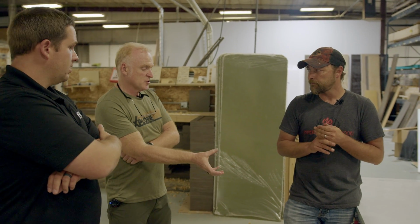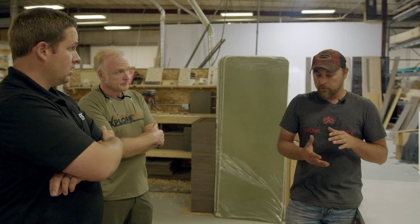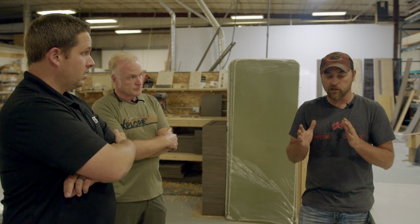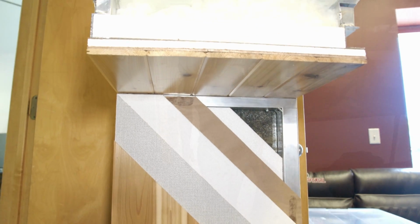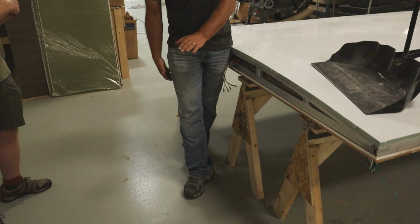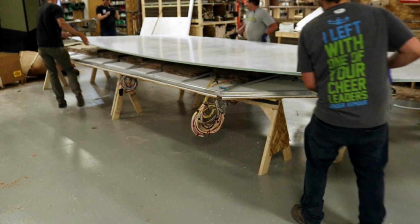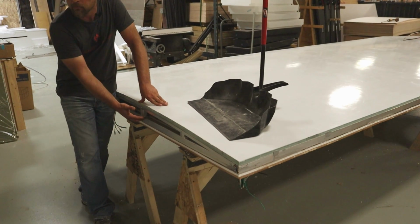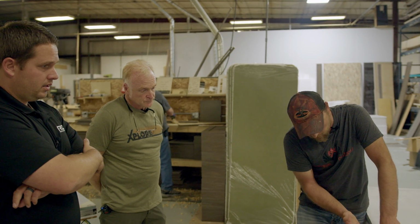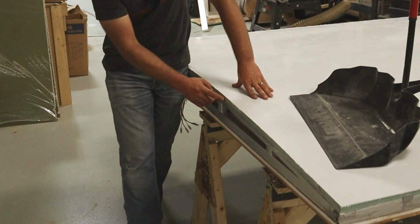The sandwich is also so important. There's so many pieces that go up to make the whole, not just the PET, but the way we build that. There's a lot of layers to everything that we build. The roof system, the wall systems, and each layer that we do all has a purpose. In the roof, this high density foam that we see here runs continuously as one sheet through the entire roof. No seams, and the aluminum is a conductor. So cold and heat will conduct through aluminum quite easily. So you can see here, our first thermal break from the outside elements is our foam core here.